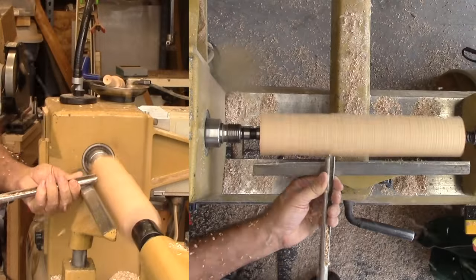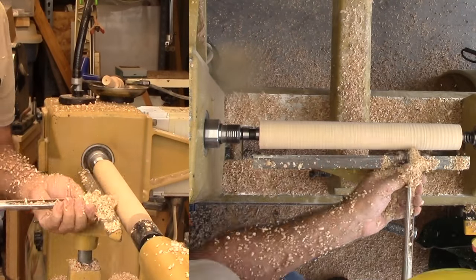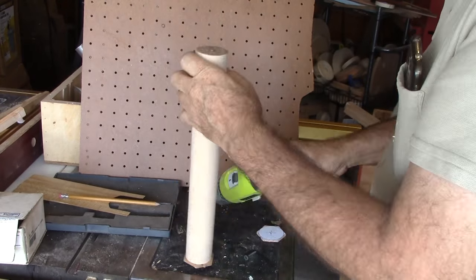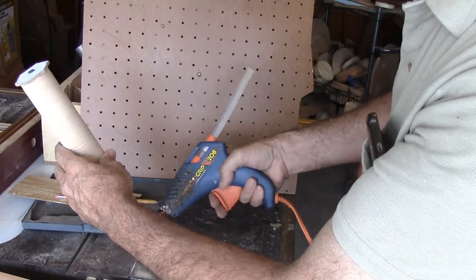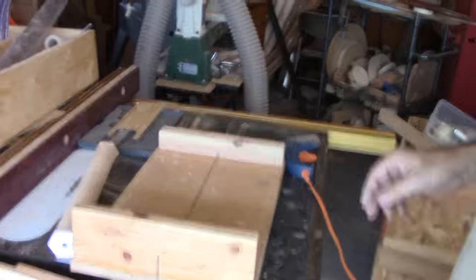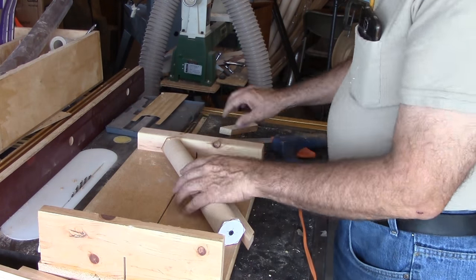Now to prep the wood for the handle. All I want to do right now is rough turn it round into a consistent cylinder. Similar to last week's video, I need a template. This time I made a hexagon for a six-loop Celtic knot. I plan to offset every other loop by about a half by putting a spacer at the end of the blank in the cutting sled. Now I'm screwing the plywood template to the end of the wood blank, remembering to apply hot melt to keep the plywood template from rotating on the screw.